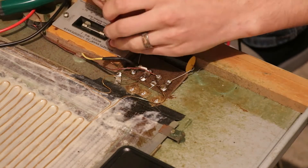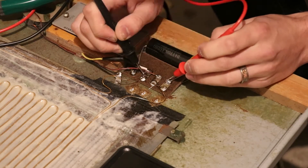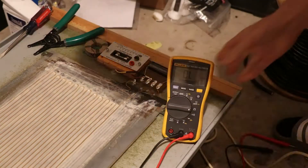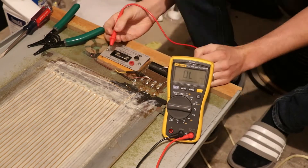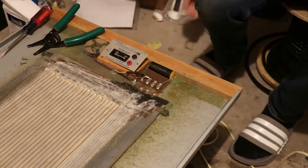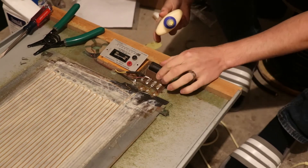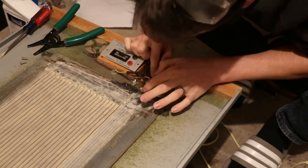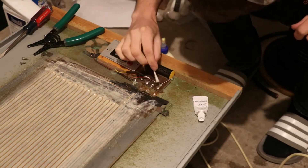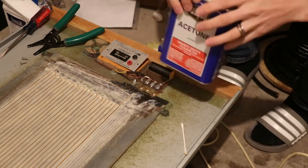Be patient and make sure you have a really good-looking solder joint at the end, because it's important for a good connection. I'm checking for resistance to make sure it's not an open circuit — I've got 5 ohms at the terminals, which is exactly what you want. So now I'm trimming back the wires behind the solder posts, applying some wood glue to hold things down, and the last step is to put sealant on the solder terminals — clean them with acetone, put down the sealant, and let it dry.